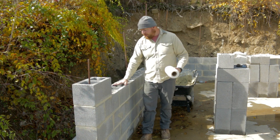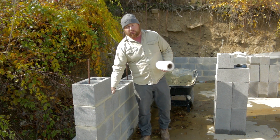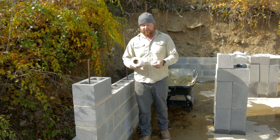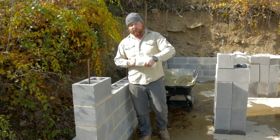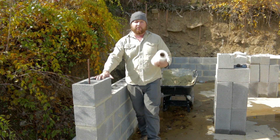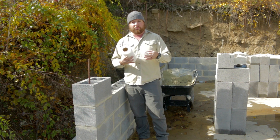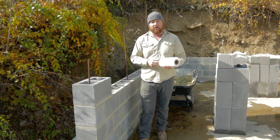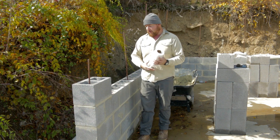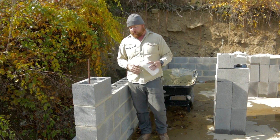What we're doing is laying this down on this course right here, so when we were putting our bond beam blocks on here, the grout stop is in between. When we go to fill these cores, the cement stops right here — this mesh is going to catch it. When we do fill this, we're going to make sure we don't do it very wet to have it sink down through. We want the concrete to get around the rebar, but we don't want all of that cream going down through our mesh. If we just stick our vibe in there and vibe the living crap out of it, we're going to sink all that cream down and it's going to pass through our mesh. So it's going to be a little bit of playing there to get that perfect cement without having it go through.